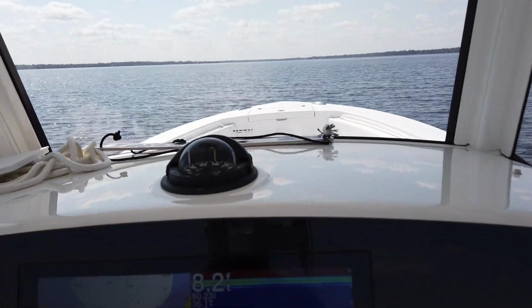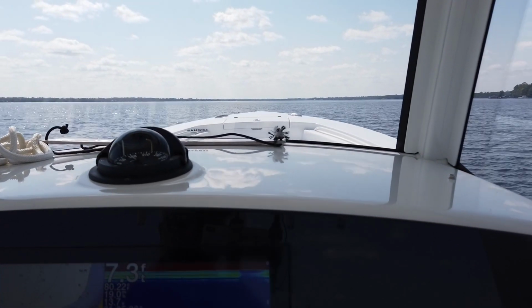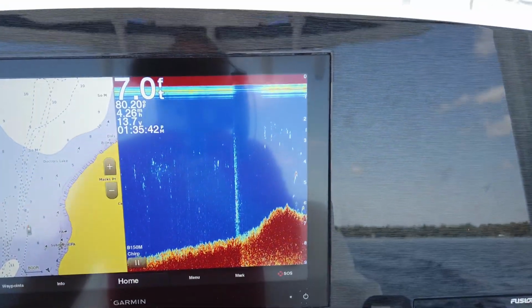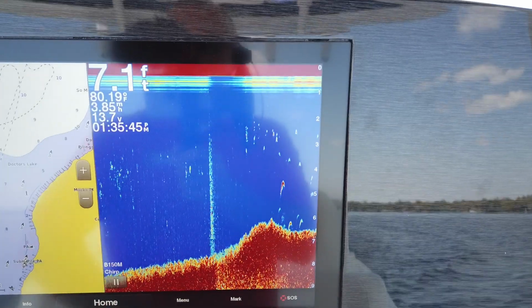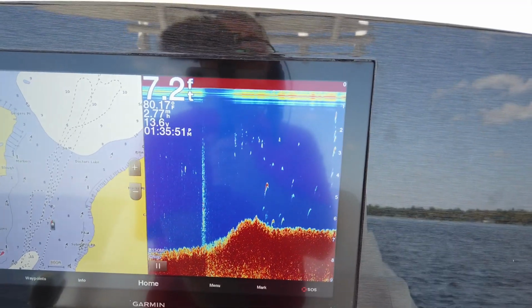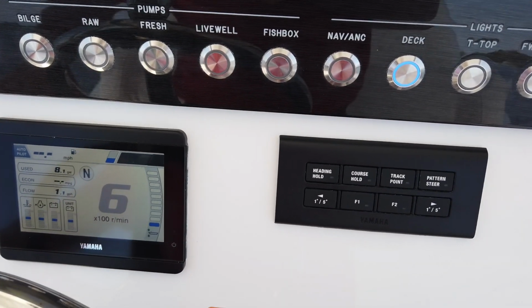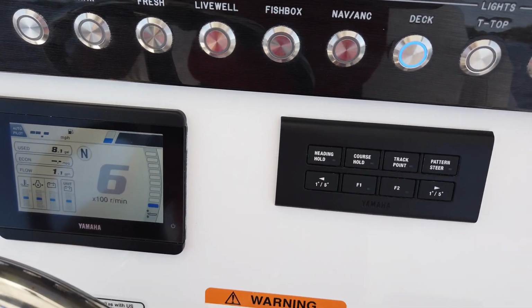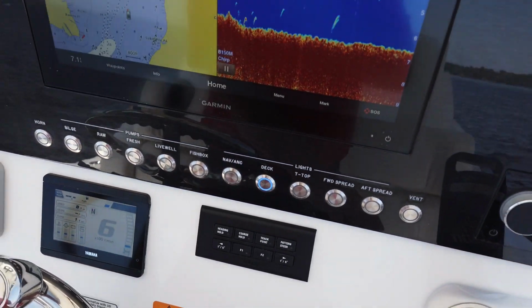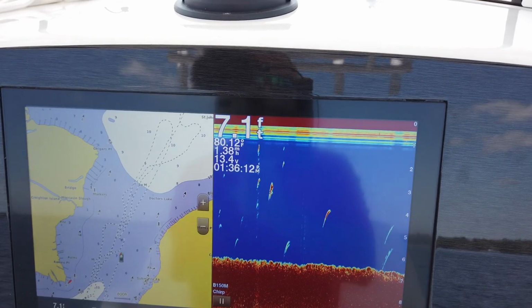Do it again here real quick because I need to get a little more specific on it. And we'll get time to plane and then a 0 to 30 run. But the boat, I believe, is capable of planing somewhere around 3,100 RPM, what I was finding earlier. But another full throttle start here. Jack plate all the way down. Trim tabs all the way down. Engine trim all the way down. Take a look at the GPS. In gear. And full throttle.